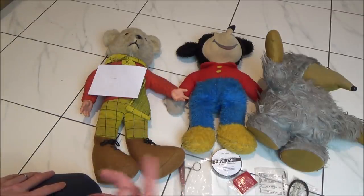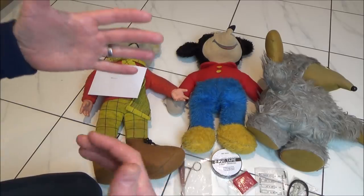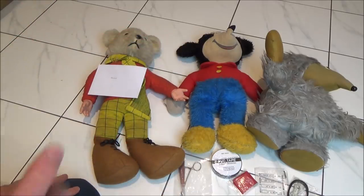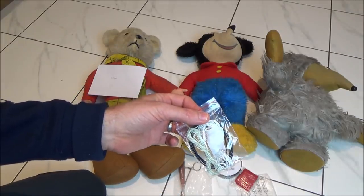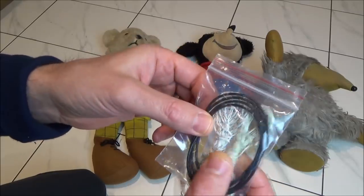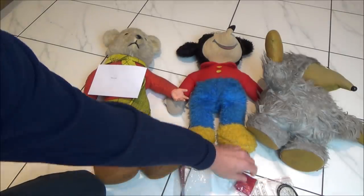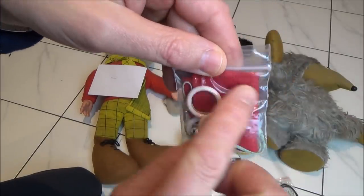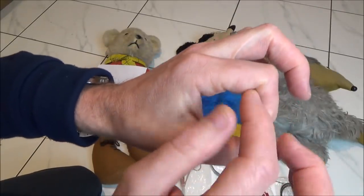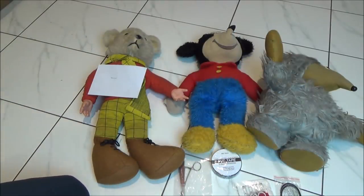So Martin has been contacting me back and forth, and he has been so helpful. I mean, I can't even tell you how helpful he has been. So he's basically told me everything that I need to do. And not just that, he's also given me spares as well. So on the last one, I think I was using Walkman belts, but he's given me the proper O-rings to use, the right size and stuff, because it all makes a difference. Too tight, too loose, it's all going to make a difference. He's given me the pull cords to use, all little things in here. The rings that you need to actually pull with, ferrules, and little felts in case the governor thing that spins round wears down, and then it doesn't slow down because it pushes out. It will make more sense later. But he's basically given me so much help.